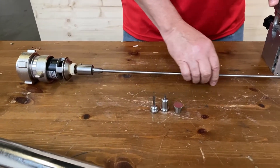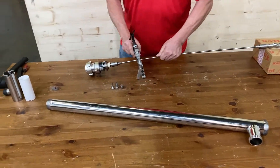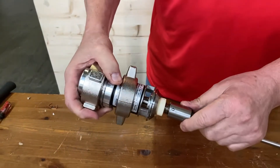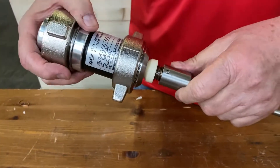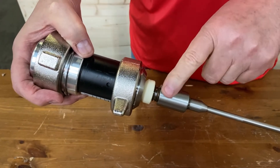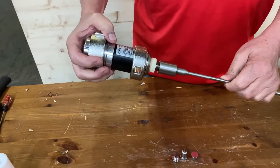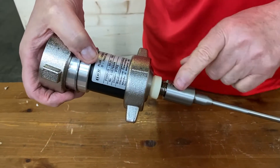The first thing you do is slide it into here and put it by your pin. Let me show you one thing to remove this: there's a pin that holds it to the shaft, and there are two ends to the pin — it's basically just like a nail. You have a head and then the bottom. The big difference is at the head they put three grooves in it, which expands the head. So once you press it in, it holds the shaft onto the main shaft. When you take it out, you have to make sure you take it out from the opposite end of the three slots, which is the clean end.